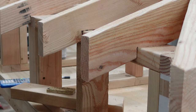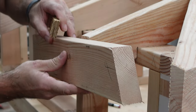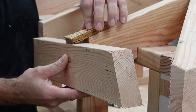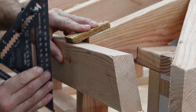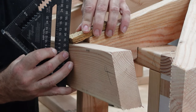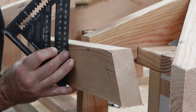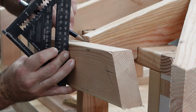Once all the tails are cut, it's almost time to fasten on the sub fascia. First, however, we need to figure out the height of the sub fascia on the rafter tails. For this I just take a scrap piece of the sheeting I'm going to be using on the roof and a small piece of 2x material, and use them to get my height. I place the 2x material on the tail and the sheathing on top of the rafter, and keep my speed square on the face of the 2x to make sure the sheathing doesn't go past the edge. I move the 2x up and down until the sheathing just rests on it. When it's where I want it to be, I mark the top of the 2x piece.